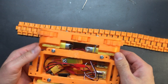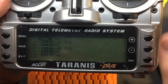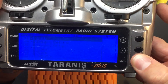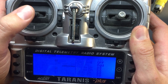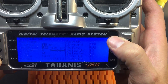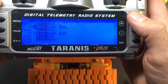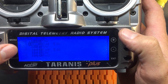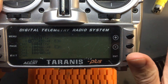So when you put the links on, this is how I set it up on the transmitter: motor one is on channel one, motor two is on channel two. I hold this and insert after, and the source will be the yaw, so this will make it turn — going forward and backwards, left and right, basically rudder. What it does is motor one forward and backwards makes both motors go forward; if I go left or right, one motor goes forward and the other goes backwards. You do that by inserting after and making it controlled by rudder.